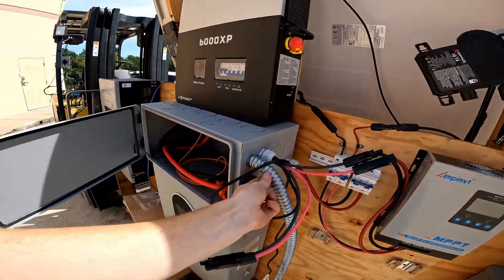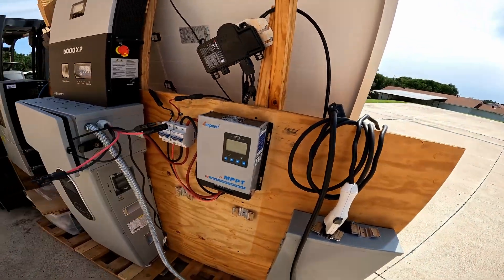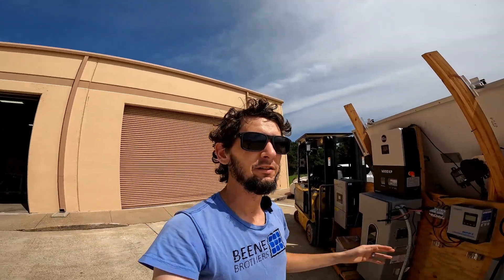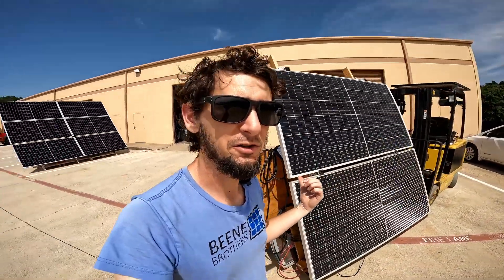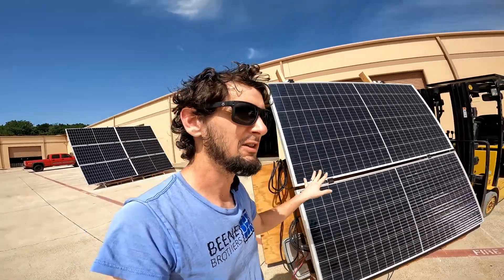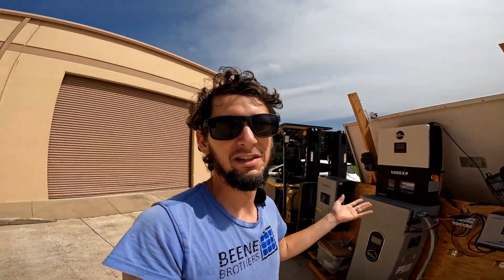You can run your AC and your solar out to the conduit box. For me, I had to add a small external solar charge controller. Why? Because the built-in solar charge controller requires at least 120 volts to fire up and start charging. Each of these panels is about 49 volts open circuit, so even with two in series I'm hitting around 80 volts under load in cool weather. I'd need three or four panels to reach 120V, and that wouldn't fit on my pallet — design constraint.